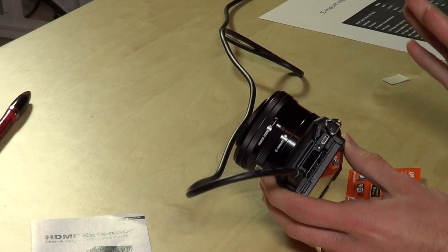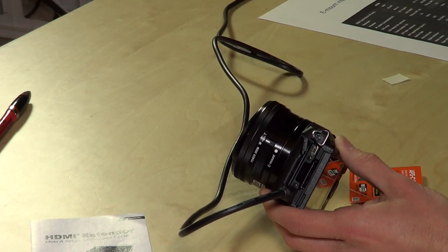I did an unscientific test to confirm it's truly uncompressed — pointing the camera at myself, my lips are pretty much in sync with the audio, which tells me the camera isn't processing the video after it leaves the sensor; it's just pushing high-def video out over the wire. However, there are two issues for professional video creators: first, you can't use the camera while it's plugged into power — it just looks for a data connection. Second, it lacks a microphone port, so you can't bring in external audio, though you could record audio separately and sync it in post-production.